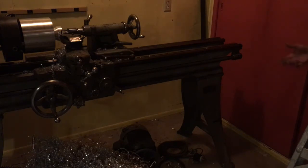The serial number card will also tell you what the lathe originally sold with and any kind of special features that it might have had. So say you look at the serial number card and it might say, oh, this lathe sold originally with a taper attachment and 2 chucks and a turret tailstock or something like that. So kind of a nice way to go if you're so inclined. However, the previous 2 methods are free. And I really hope this helps out, finding out when your machine was made.